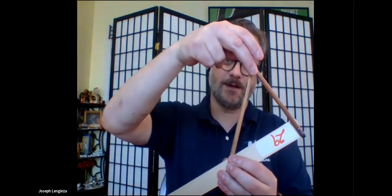When it's done in modern vessels, I say modern, when it's done by modern people in historic vessels, a lot of these are lofted up using thin plywood and hot glue guns. So you draw out on the lofting floor the arc you'd like to see, and then you stick together little pieces of plywood that compound to make all of, not necessarily the shape itself, but all of the extreme points. And then you derive the shape of the actual cut lumber from that.